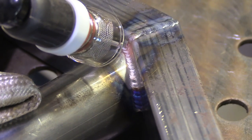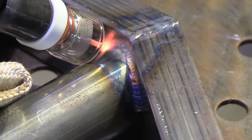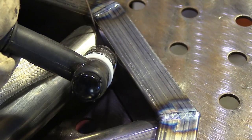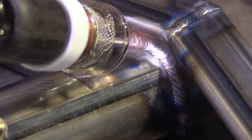On certain thicknesses it's very hard not to penetrate through completely even when you try not to. I'm pushing enough rod in and I can look through the clear number 12 cup — another benefit of that setup. I backed off on the heat just a little bit more than the previous joint and it's going better. If the puddle gets a little hot, those ripples get kind of V-shaped — that's an indicator you're a little too hot on a fillet weld on TIG.